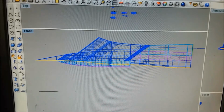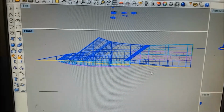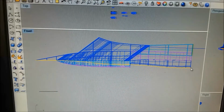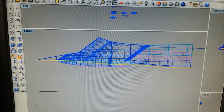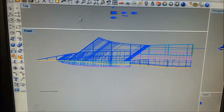Anyway, the air comes in here, gets forced down, and in the actual drawings there will be a metal strip that starts about at the end of this curve. It goes down to about 1.5 inches below these, and then it runs level, the running level, whatever it is when it floats, back to the back. And that traps the air in the center to make it provide lift, basically. As long as it doesn't cause anything to suck down, you're breaking cavitation of the water underneath here.